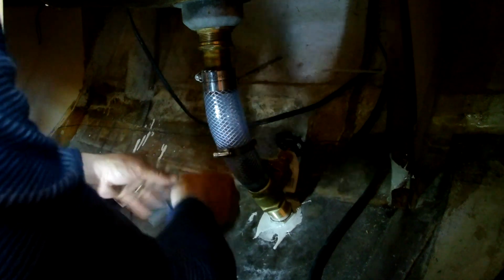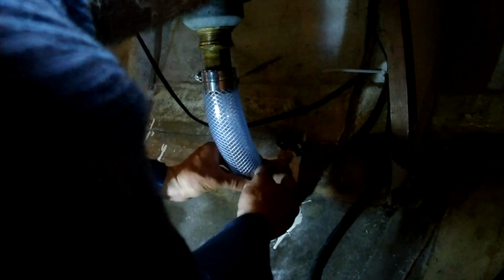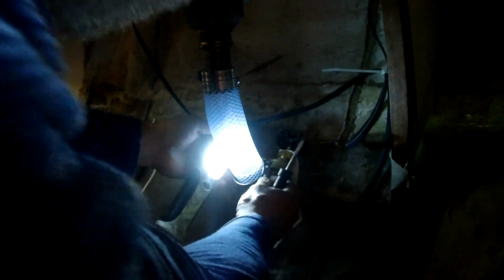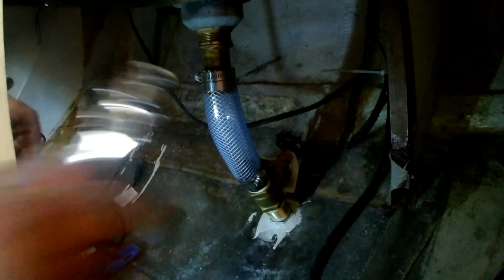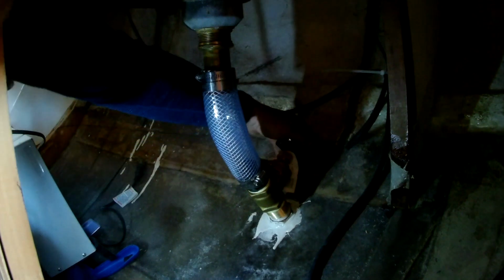On a boat, every exit point, fuel, anything is supposed to be double clamped. So you can see the shadow here. That first one is on the boat bottom part, but there's still lots of black there for this one to grab onto. See how this works. Like I said, worst case scenario, you just gotta close the shut-off valve again.